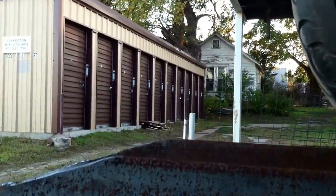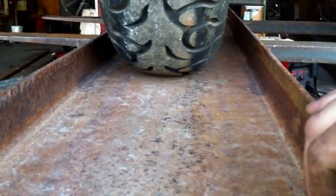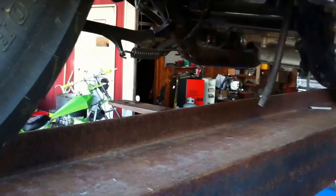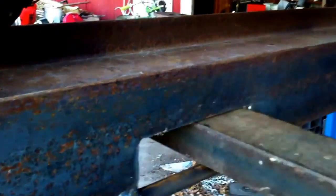The only downside to this little table that I made — I'll lower it down to show you. The I-beam flange is about an inch and three-quarters, and so that will limit me when I'm trying to reach up underneath the bike, like to change an oil filter maybe — it might get in my way, so it's not a flat tabletop. I couldn't cut that off because of how I had to cut these out; I would lose the strength of the I-beam.